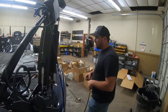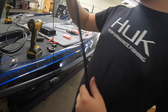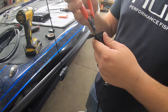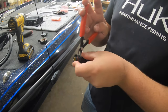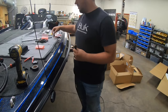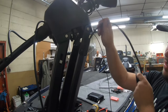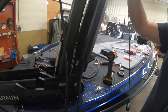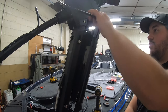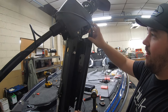This next step is going to scare a lot of people but trust me it's not going to hurt anything. We're going to take and cut this collar off because Garmin has a cable management system right through here, but that collar is too big to fit through. We're just going to break that collar off. In your LiveScope system box you're going to have a replacement set — same size as what comes for the network cables. That allows us to run the cable down through the channel, so you don't have to worry about it laying up on the boat. Like a lot of people did when these first came out — they had to make some kind of management system — but this channel keeps it protected and there's a lot less chance of something happening to it.